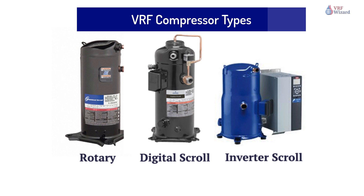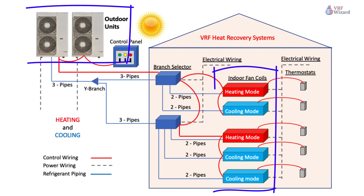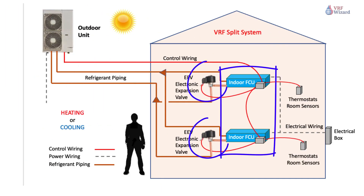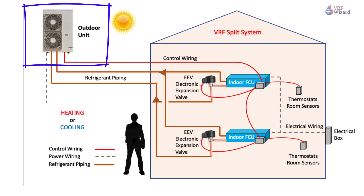The compressor is the heart of the system and is located within the outdoor unit, which can be an air-cooled or a water-cooled VRF system. The outdoor unit will serve multiple indoor units, with each VRF manufacturer limiting the quantity of indoor units connected to any combination of outdoor units. The VRF system varies the flow of refrigerant to each of the connected indoor units based on the needs of that unit, allowing the system to adjust the volume based on demand. Each indoor unit uses an expansion valve to control its refrigerant supply to match the cooling and heating demand of the space it serves. The outdoor unit also varies its output to match the total demand of all indoor units.